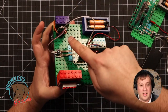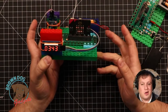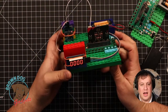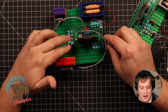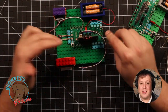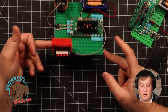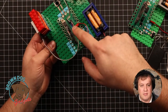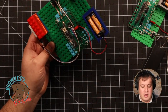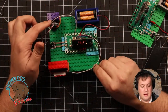So we're using a very simple real-time clock module. It has a spot for a battery, the same way your clocks keep time, with a little battery backup. It keeps time way more accurately than the onboard controller. And if you lose power, it'll still keep going. We did this by plugging into those pin headers on our board a simple 7-segment display and a real-time clock module.